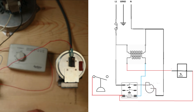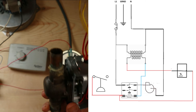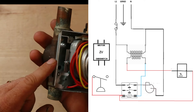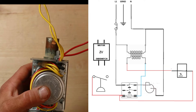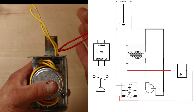So what we have now is: when our humidistat closes, it'll energize this coil, the inducer draft motor will start, the pressure switch will close, and the 24 volts available from the coil will be able to flow through the switch. Now let's take our power from the other side of this switch and turn something on with that - let's use a Honeywell zone valve. These zone valves have four wires: the two yellow wires power a motor, and when that motor lever opens all the way, it pushes in a little black button - a switch called an end switch - which closes the circuit on the two red wires.